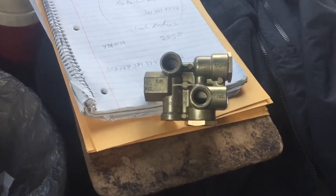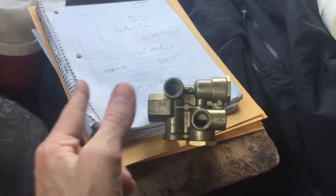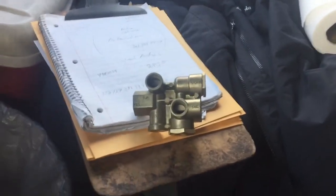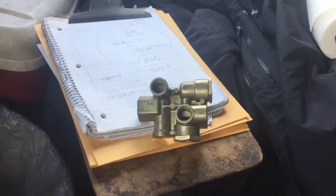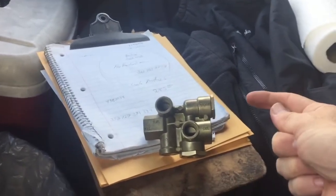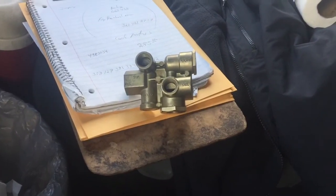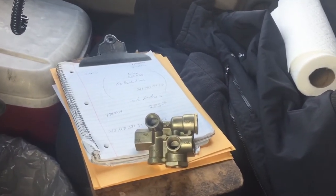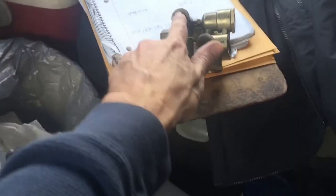If you're hearing air go to the trailer, then it's most likely gonna be this valve right here. There's only two or three valves underneath that trailer: the ABS one for the service side of the brakes when you push the pedal, and this one's the supply to release the spring brakes. It actually pumps up the airbags — runs through this one to pump up the airbags, so when you pull the brakes you steadily lose air. I think this one right here is the signal line — so when you press in the red line it opens it up to release. Another red line would be going into that one to constantly supply air, even if the red brake is set, so you're still supplying air to the trailer to pump up the airbags and fill up the tank.